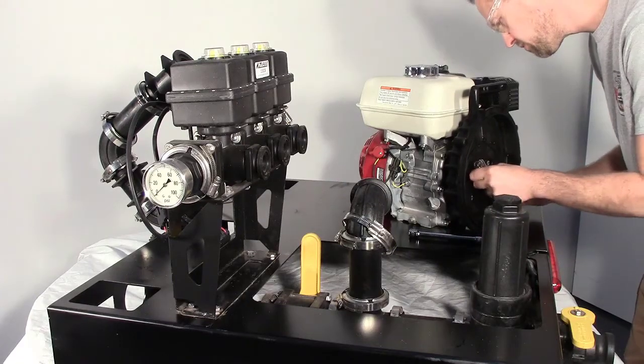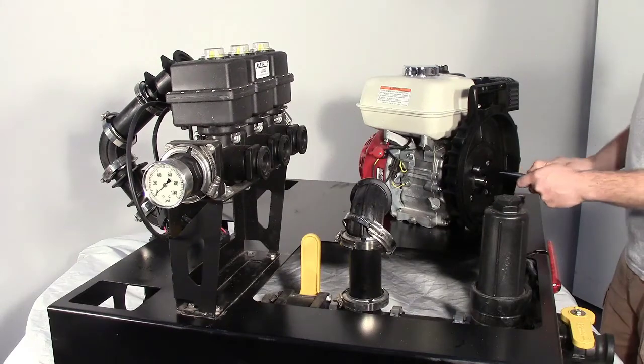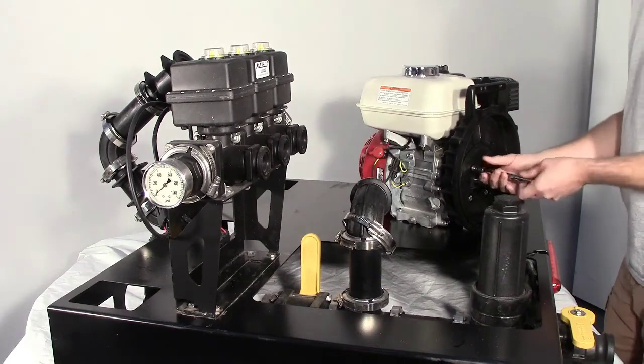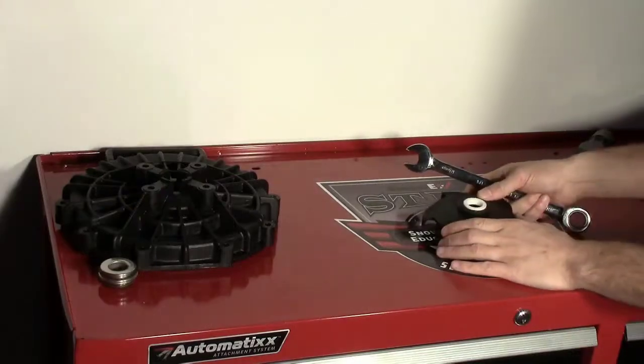Place a flat washer and screw head O-ring on each of the 4 cap screws. Install the rear bracket onto the engine using the bracket screw assemblies from the previous step. The handle of the rear bracket should be on top of the drive unit. Tighten securely.